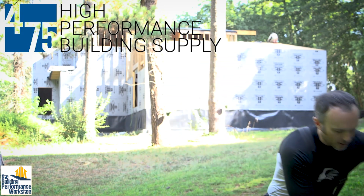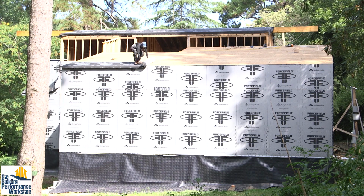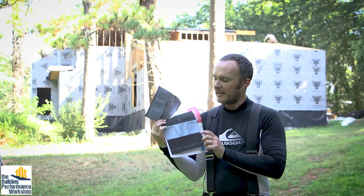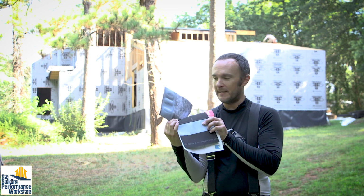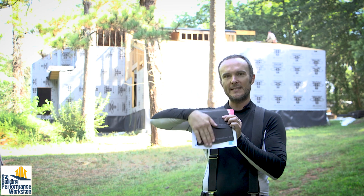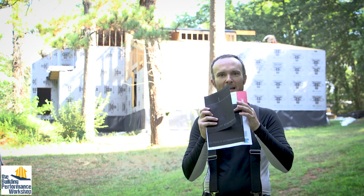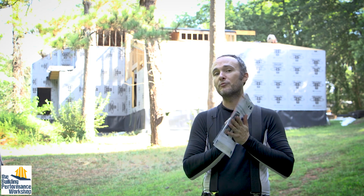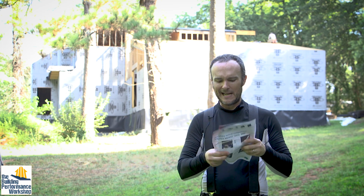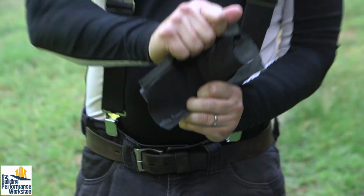Now let me show you just how this works. First, you put the lower level. So I'm going to do the very bottom portion of the roof first. Make sure that it's overlapping the force field so that I can seal that. Then I'm going to have this tape strip here. I'm going to overlap that with the upper level's tape strip so that when water comes along this, it's going to shed. And all I have to do is peel off the protective backing and then press the two together. And I want to press them pretty firmly. That's why I'm using things like that squeegee. But even if I do a pretty half-assed job, you can see that this stuff is pretty hardcore.